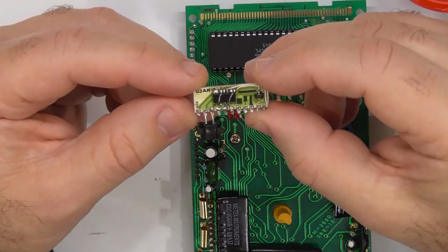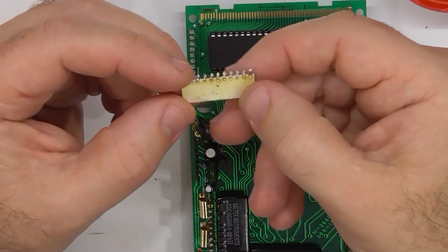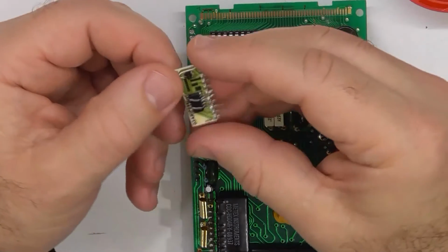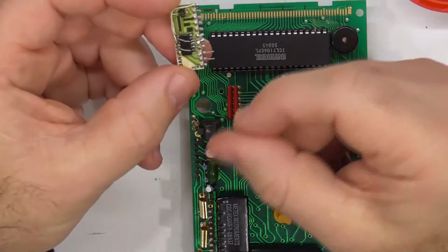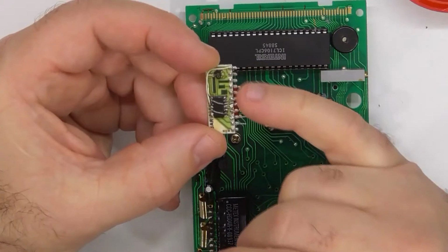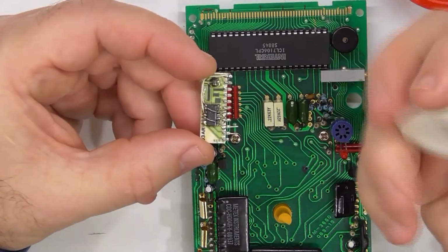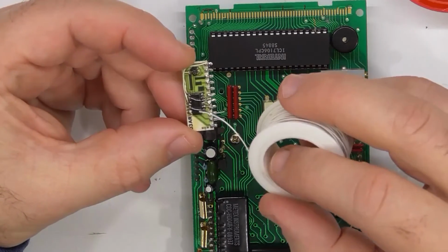On this particular module, I've put some Estopol on it. I was going to go look for some replacement pins here. These are just soldered on to the board, but I thought I'm going to leave it alone because I've already ripped off enough pads as it is. So what I'm just going to do is feed in some wire, similar to what I've got here. This is all one type of wire. I should actually find out what gauge it is. I think it's 30 gauge. Some of them have still got the insulation on, others I just stripped the insulation off. So these are easy, just have to strip the insulation off. All these connections in between here, the pads.